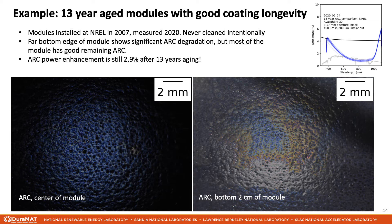We see some locations with blue reflection, which means full coating thickness. However, we see other regions with magenta and yellow reflection — these locations have significant anti-reflection coating degradation. Further, there are even some locations with white reflection, indicating full anti-reflection coating removal. The vast majority of this module has blue reflection, so in general this is a minimally degraded coating. However, this example does lead us to say that heavy soiling appears to accelerate degradation.